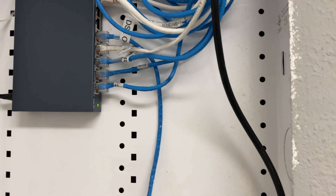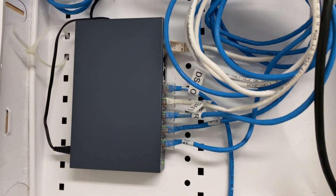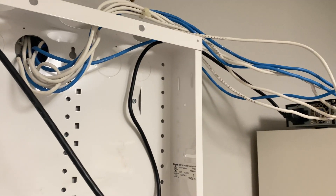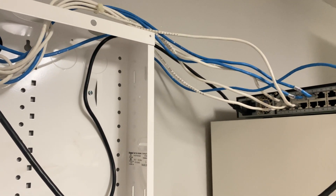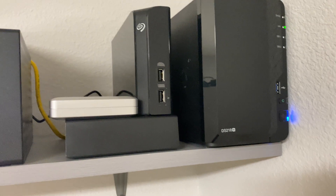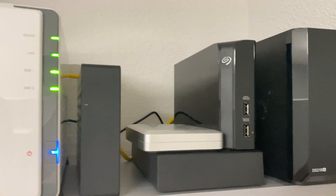This house has somewhat of a structured wiring setup. They added all the wiring to the living room, the master bedroom, and a few other rooms, and they have all the security camera wiring throughout the house. But in a room like this — the home office, the den area — they didn't put any data ports. What I wanted to do was put an ethernet port so I could have my gigabit network throughout the house and actually write to my network drive at gigabit speed.